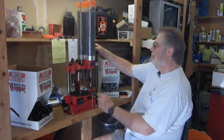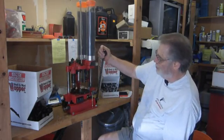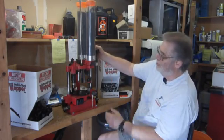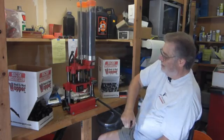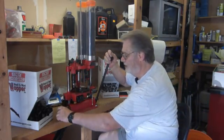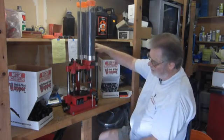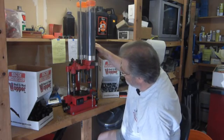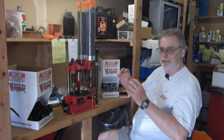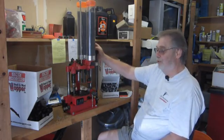So I got all these turned off. So we put the pre-crimp on it, and you can see it's come up a pretty good cone. And now it's going to go into the crimper itself, and that's crimped, and that's another primer. And now it's over at, I always forget the name of this station. It's the last one to finish the crimp, to put a roll on the edge of it so it will feed through a semi-auto or into a pump gun.